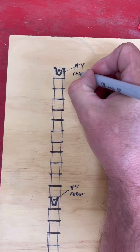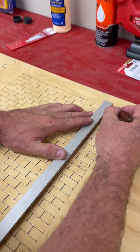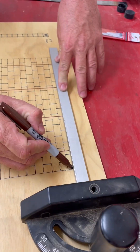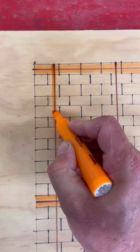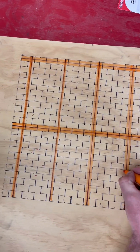Here's a diagram of the wall we're building. The brown lines represent half inch rebar that are placed vertically four foot on center through the block cores. The horizontal lines represent the rebar in the two bond beams. I highlighted both the horizontal bond beams and all the vertical cores that get filled with rebar and concrete to show how this makes a post and beam type structure to reinforce the entire wall.